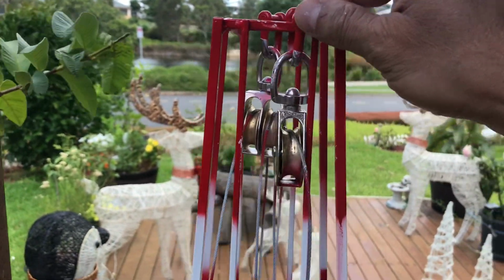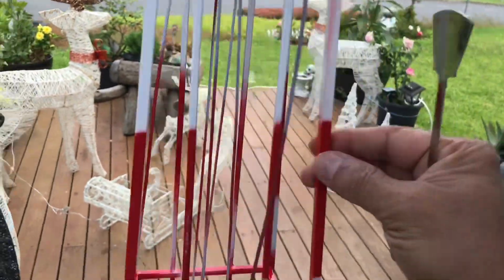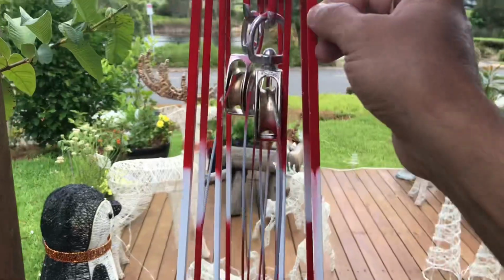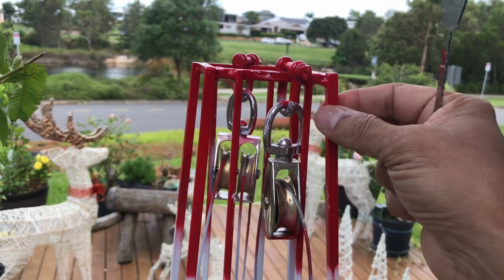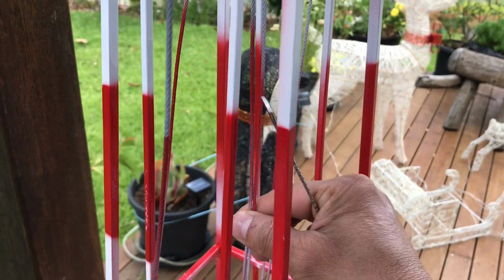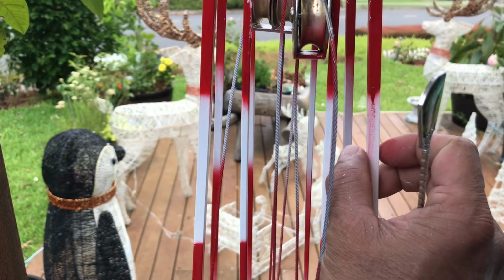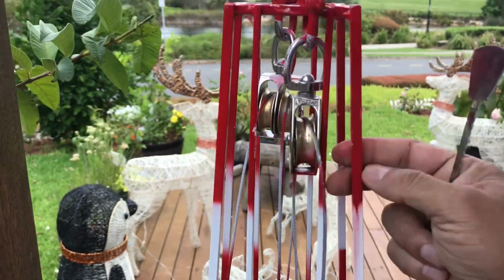So this is determined by the technical team, by the technical engineer who designs the whole rig. The more strength in your mast, the more capacity you have in the construction of this mast. So horsepower is actually not horsepower, it is the strength of how many million pounds you can lift with this traveling block. Simple technology. The wider you go on your beam dimensions, the more strength you have on this drilling mast.